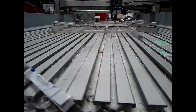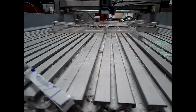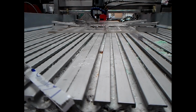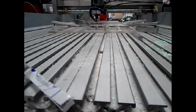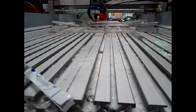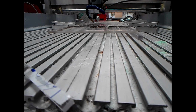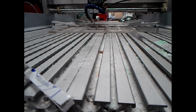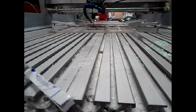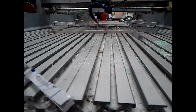For the brain, I have a small component box to house a microchip PIC 16F676. This circuit is supplied with 24 volt DC and generates its own 5 volts to power the microcontroller and as a reference voltage to supply the ACS712 Hall effect sensor. This little component box has 2 inputs, which can be used as analog or 5 volt digital. One is being used here as analog for the PIC to read the current sensor's output.